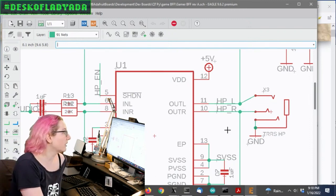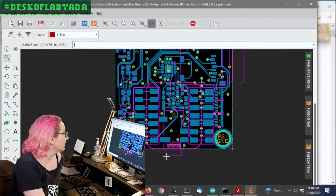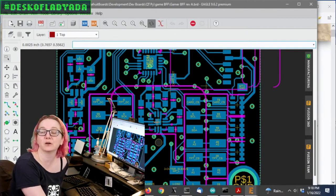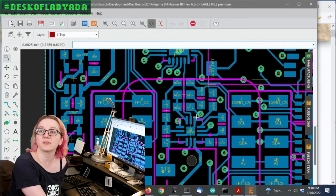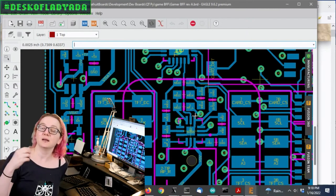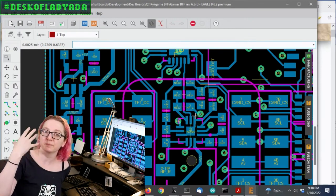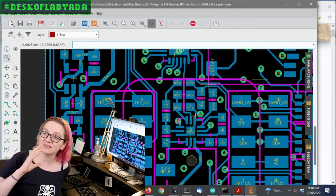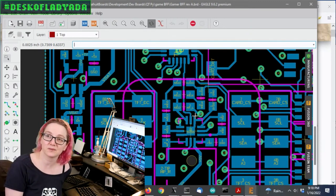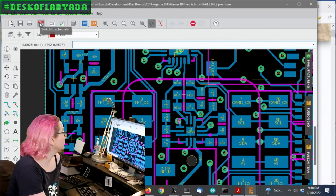But you'll notice here there aren't any. And for the design I'm doing, it has to be so tiny. The whole thing is so small, one capacitor would fit like here. It would be just way too big. I wanted something where audio goes in, maybe there's a couple of resistors and capacitors just for getting the signal in and doing the volume gain select. But for the most part, I don't want those big chunky caps, because even ceramic ones are just way too big, or tantalum, they're just too big. So this is a no cap headphone amp design.